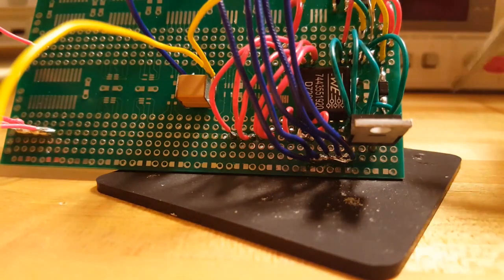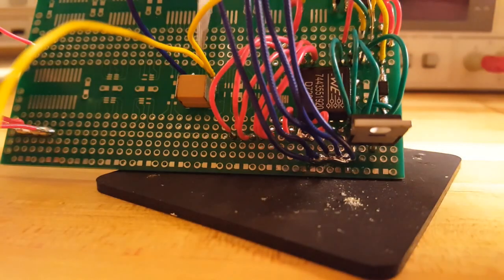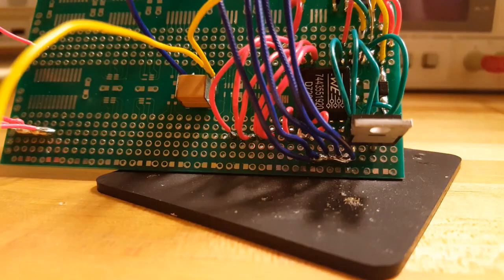Inductor, switch, diode, and capacitor. We are expecting several amps of current, and PCB traces have a limited capacity. For example, these 10 mil traces can only handle about 1.5 amps. Therefore, for safety, we've connected many wires in parallel to ensure that we can carry the current we need. This is pretty silly, so in the final PCB we will just use big traces.